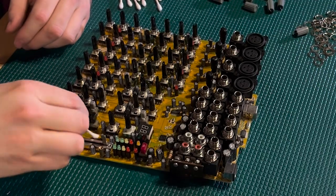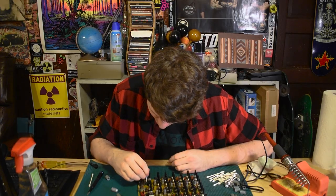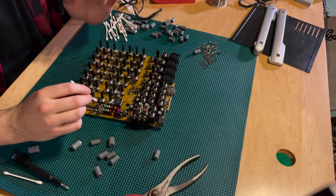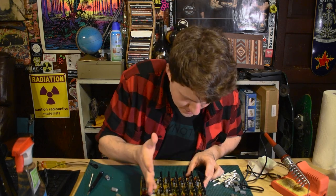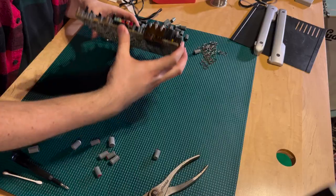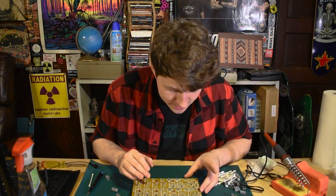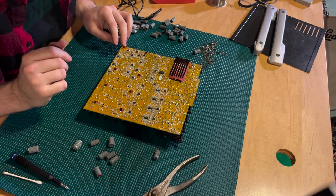These things are coming up black. Doing little extra passes through stuff to try to make sure that we get as much as we can. There's not a whole lot we can do with some of these spots — we would have to desolder things off of the board to then clean up underneath. And I think that this board is in better shape than that is necessary. I think we've cleaned up what we can. The rest of the board looks clean. There's nothing else going on here. It was really just that one area that the gunk was on top and went through. I'm going to check the bottom just to see if there's anything that needs to be re-soldered and fixed up. Nothing looks messed up down here.